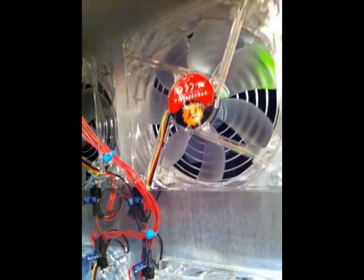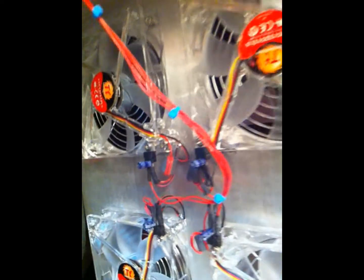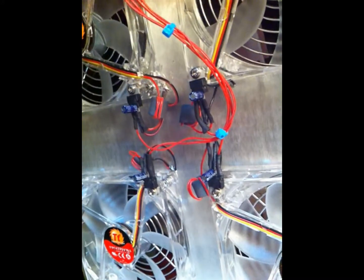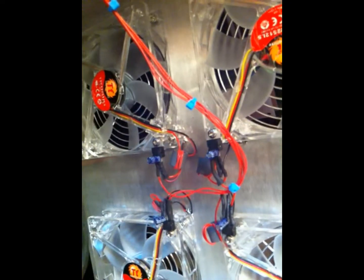And here are the fans. As usual, especially on these guys, these blue LED fans are actually very sensitive to RF, so we have to take extra precaution and do some extra filtering. They definitely have to be regulated because they're very sensitive to voltage too.